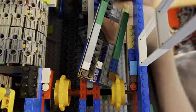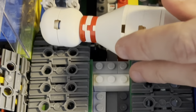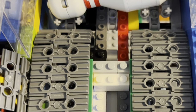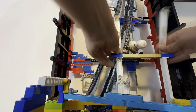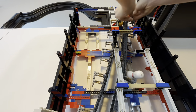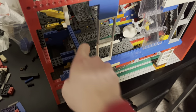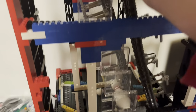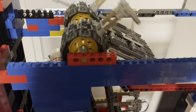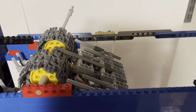With a quick redesign of the bottom treads we should be ready to test it out. The pin hooks are able to go through the gap and pick up the pins. Those glass panels are there to ensure the pins do not fall off, so let's build those up. Now we should be ready for a full test. The bottom treads push the pins into the pin lifter, the hooks grab them and pull them up to the top. Once they reach the top, they go into a grate that has gaps where the teeth of the hooks can go through, but the pin cannot.